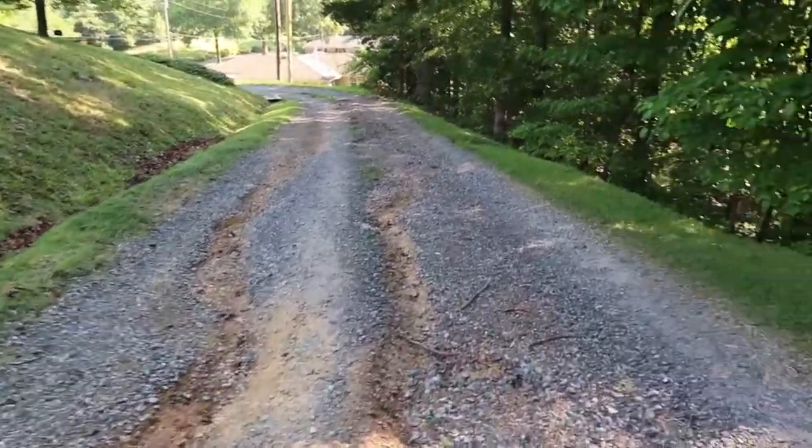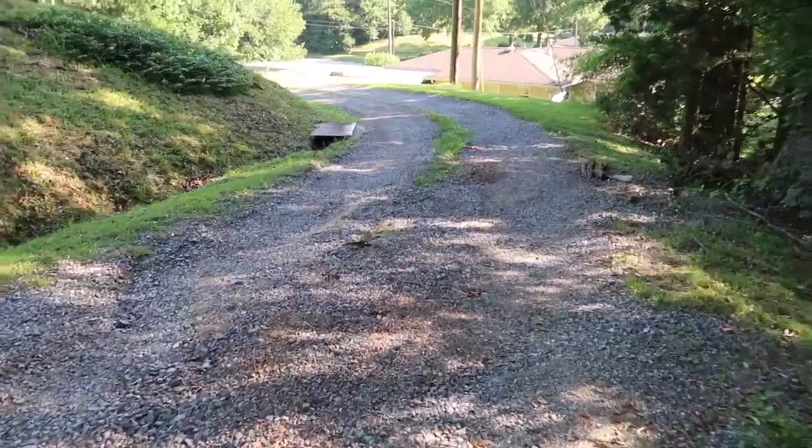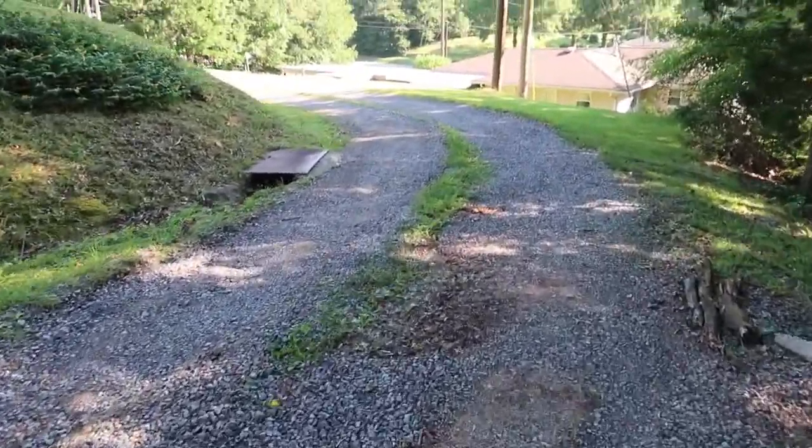We need to refinish all this side. This last little curve she says she's fine with - we're not really going to touch that because she really doesn't want to spend too much on gravel. About three years ago she brought in about six truck loads of gravel and a contracting company redid this whole driveway. Right now I'm only here to regrade the top of it because it has plenty of gravel underneath that I can bring up and resurface so she can have a smoother ride up this hill to her house.